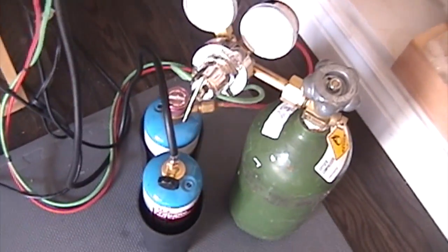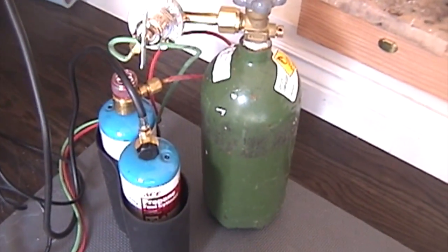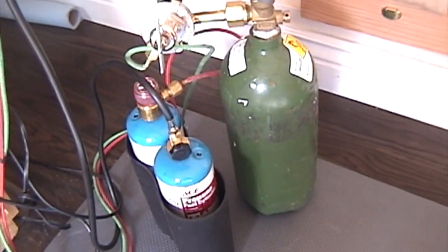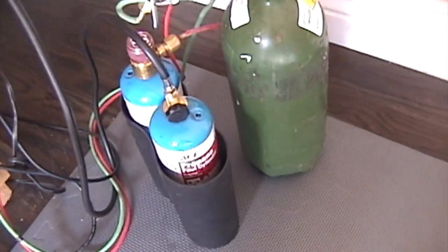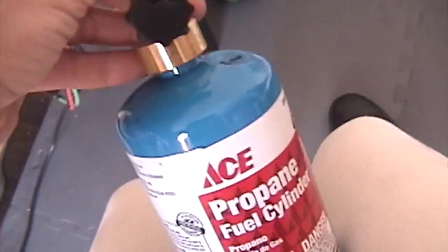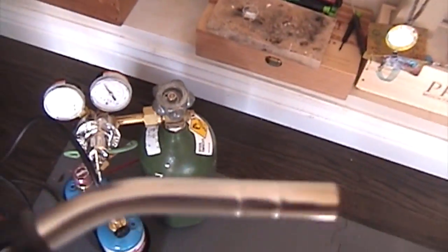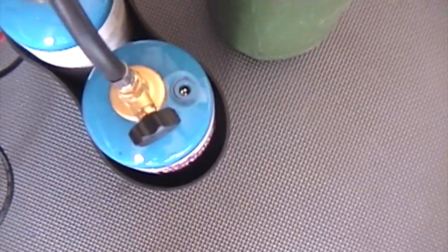This is my torch setup — actually two torch setups. These should normally be strapped against the side of your workbench. I just stick my two propane torches in a trash bucket. My first torch recommendation for someone new to metalsmithing: an Ace propane cylinder, about $4 each at Ace Hardware or Home Depot, connected via a hose that was $14, and a torch head handle for about $13.50 from Home Depot.